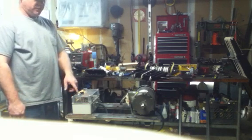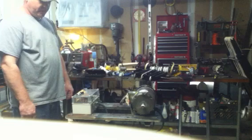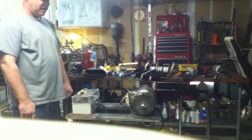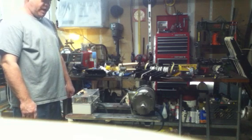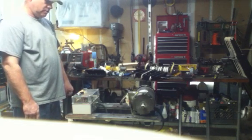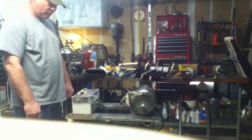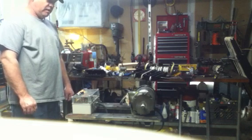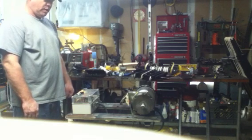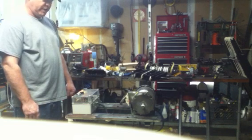We are going to fire it up one more time just so you see the illustration. This motor fires right off. The capacity of the start capacitor is such that it gets fired off right away. A larger motor will require a larger start capacitor. This particular one is a two horsepower, so even on the low end it's 145 microfarads to start up a non-loaded pony motor. If you have a seven and a half horsepower motor or larger, your values will increase.